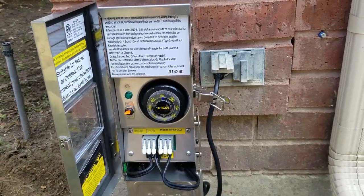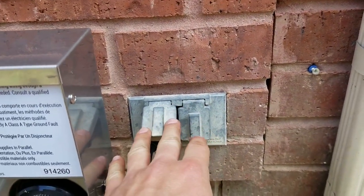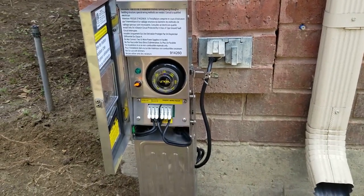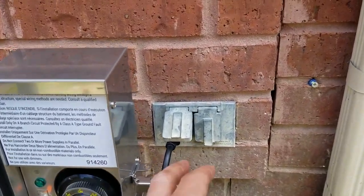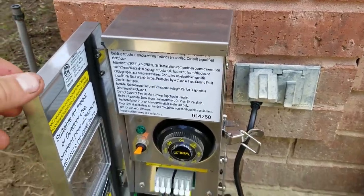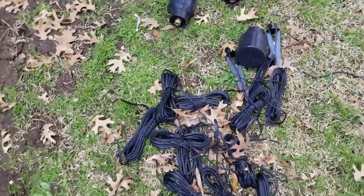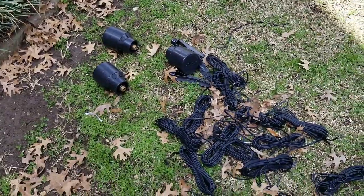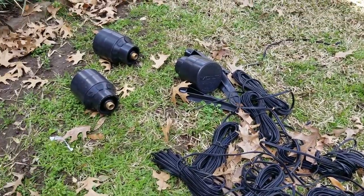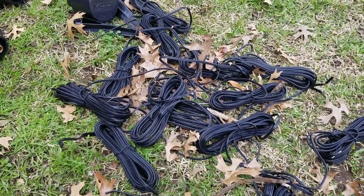The customer decided not to do this, but you need to make sure that this is a waterproof cover — it's waterproof when it's closed. Make sure you install one that's completely waterproof, because in Texas it rains really hard a lot, and this whole transformer will trip and it'll take a few hours to dry out before the lights come back on. And here's all the wire that's left over that I'll never use because of how thin it is, and those are the hubs that Volt provides that we're going to throw away. It's a shame I'm throwing away all this wire and those hubs — they should just include a little more of the thicker wire instead.